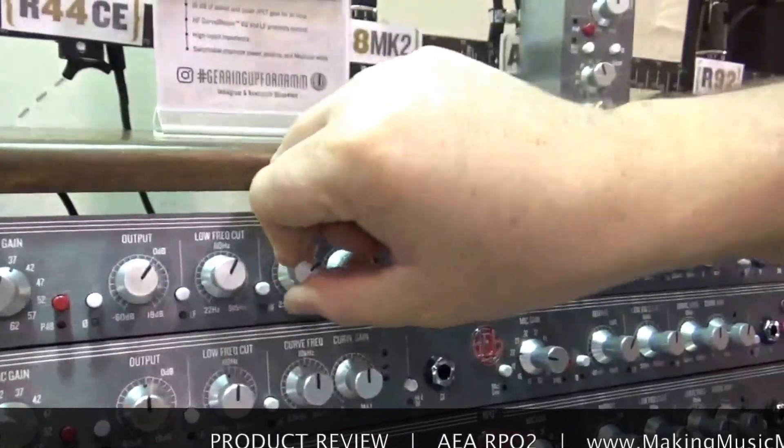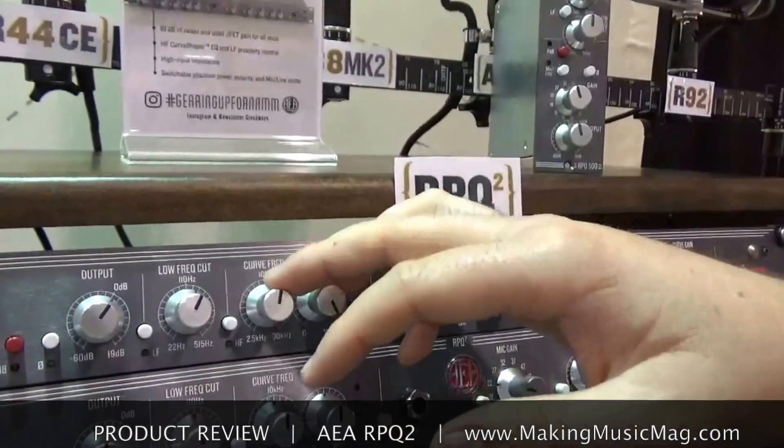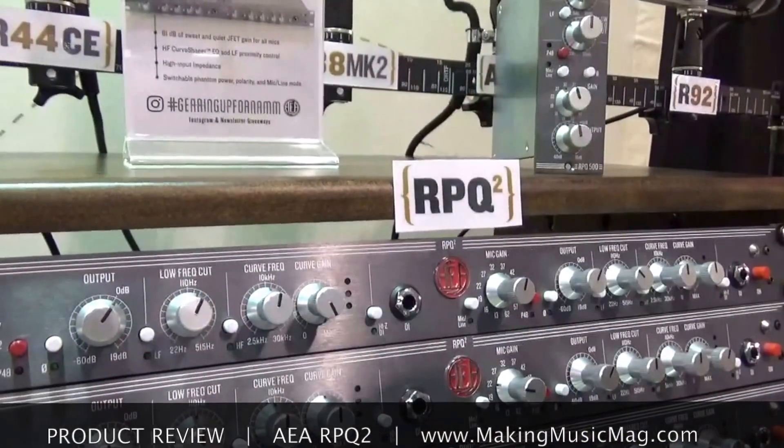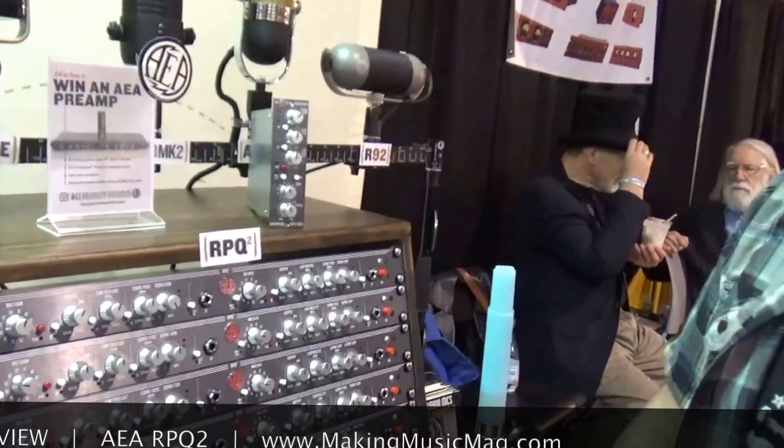When you're at like this position here you're doing 20 dB of gain at 20k, but you're also pulling up down at like 1k, 3 dB or so. So very wide Q, very musical, great for bringing up the high frequency roll-off of the ribbons.